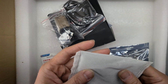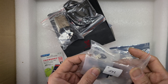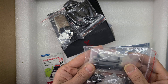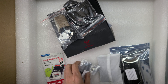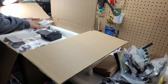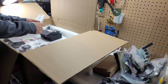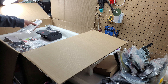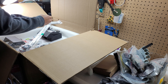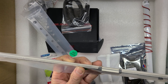Carbon fiber — I mean, this is activated carbon for the filter. And this is for the TAP probe kit. LED. And then all the linear rails. So the best way to check whether it's stainless steel or not — look at that, it magnetized a lot. So I don't think this is stainless steel, because stainless steel doesn't really stick to the magnet that strongly.